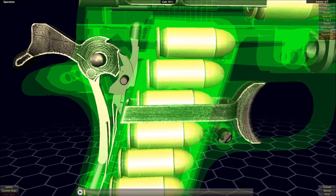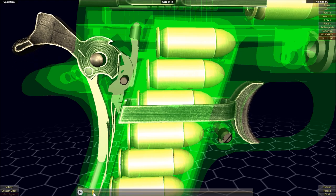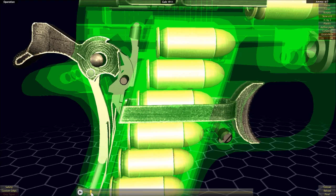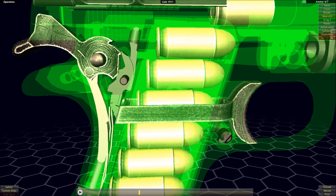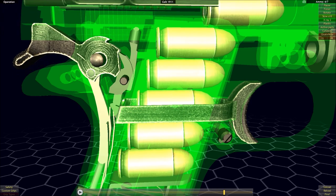With all that being said, let's go ahead and take a look at how this actually works. With the trigger pull, we see the sear being pivoted out of contact with the hammer. As soon as the sear disconnects from that hammer, the hammer drops forward. Our slide cycles, bringing the hammer back, and then our sear holds the hammer in place, preventing it from dropping forward. Even if we hold in the trigger at this point, we are not deactivating the sear.